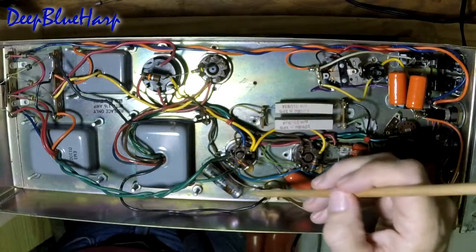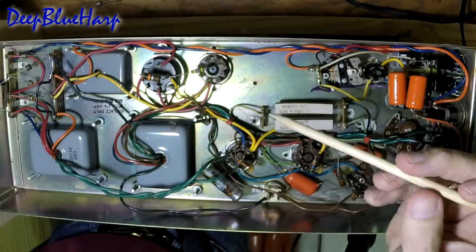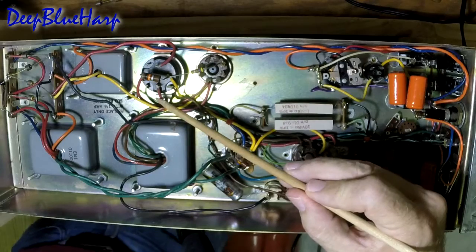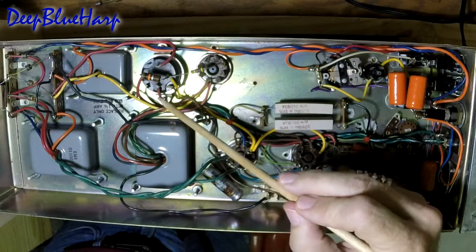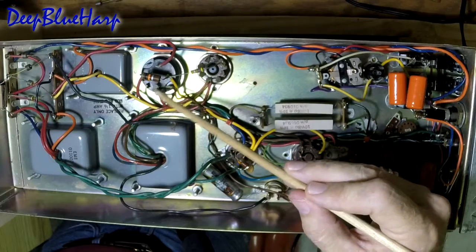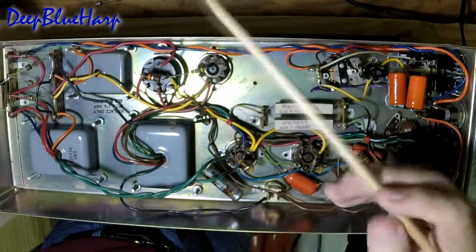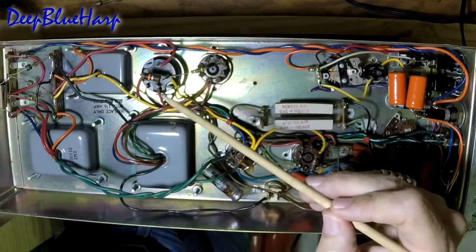How to check for this? What I'm going to do is, in the case of any capacitor, unsolder the leads and then put it on a test instrument that checks for capacitance and also check for shorting. If that's it, easy fix. If it's the can capacitor, some extra care will need to be taken. Although this unit has been down for a while and the voltage has bled off, you always check for voltage here. Voltage on this capacitor is 420 volts DC - not to be messed with. So I will test for voltage first, get a rather large resistor like this to bleed it down if necessary, send it to ground, bleed it down, and then once it's bled off, immediately - within the hour - check for capacitance across each of the can sections and check for shorting.